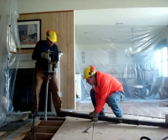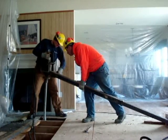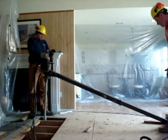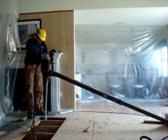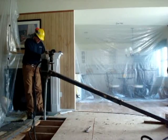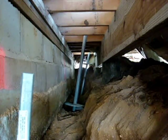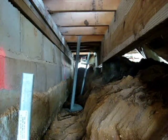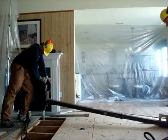In this case, we're installing Chance SS5 piles with standard underpinning bracket using portable equipment. This is a really convenient method when access is limited or installing indoors. The house in Manahawken, New Jersey had settled when the original wood pilings rotted and failed. The lead section is driven in first and additional extensions are added until the predetermined torque is achieved.